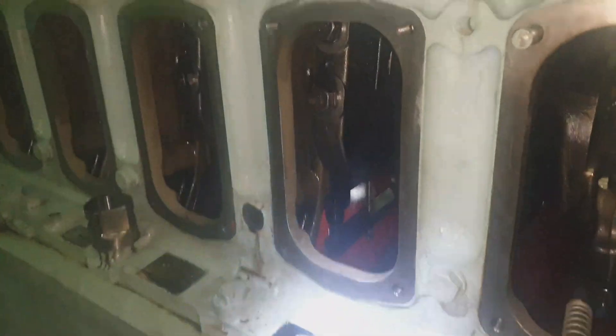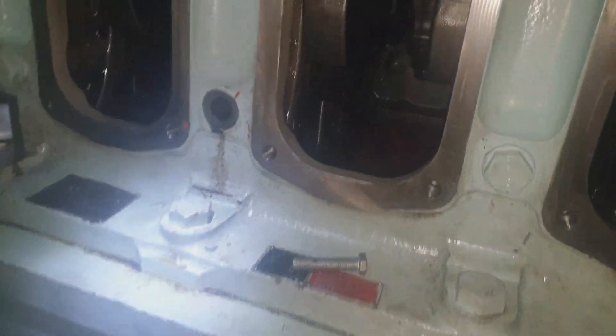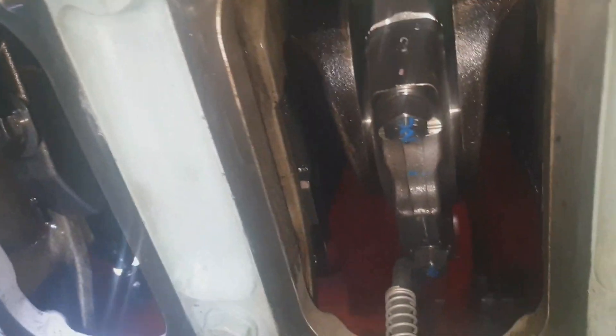As you can see, the pulling tool of the main bearing cap is already installed. The purpose of that pulling tool is to evenly pull the main bearing cap together with the main bearing assembly case.